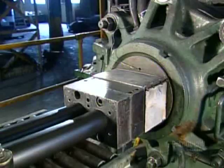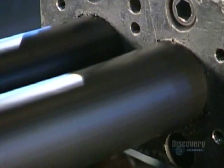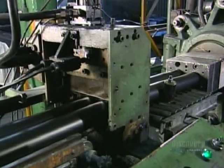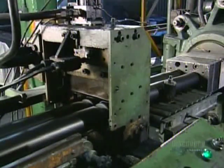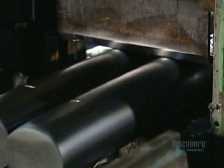The rubber hasn't yet gone through the curing process, so it's still malleable. An extrusion machine squeezes it through a round die. This produces logs about 1 meter long and 7 centimeters wide, the exact diameter of the hockey puck.